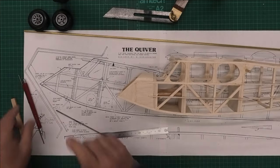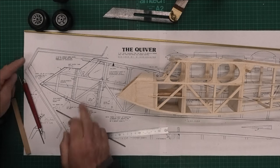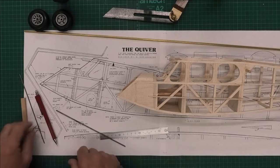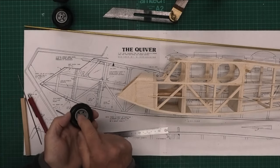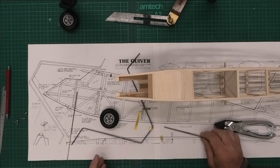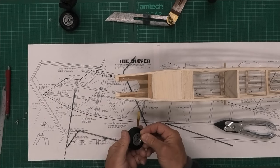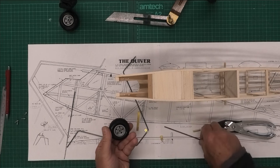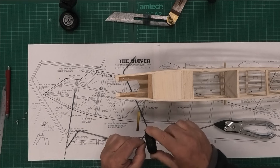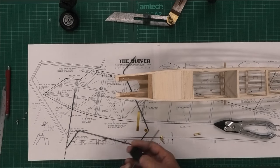The first thing I'm going to do now is get these bent up with the narrower centers, being mindful that the legs are slightly different lengths - I don't think that was intended - so we need to get those right. Quick update: I've cut a couple of brass bushings from the tube, which slide into the 4mm hole in the center of the Kavan wheels. My 14 gauge music wire goes in that, making it much better - still free, but not sloppy.